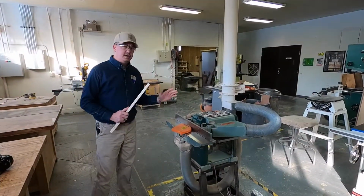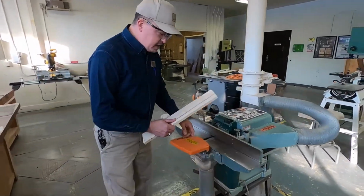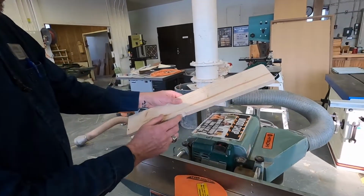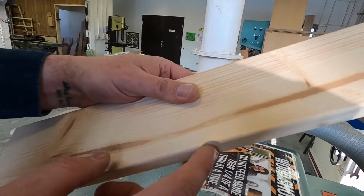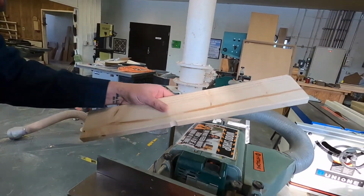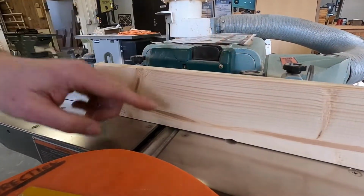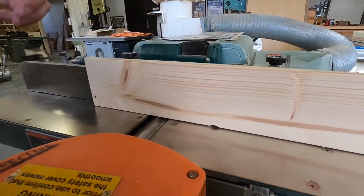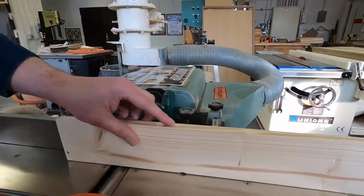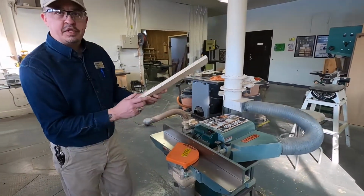Next up, we have our joiner and planer combo. The joiner here, its main job is to take out nasty edges in your wood. So if you have a chunk like we sanded out earlier, you can take the joiner here and put it through here and have this blade cut out whatever you have it set to. Right now it's set to about a 1/16 of an inch, roughly 32nd or so. And just keep feeding it through and that nice little bump will disappear.